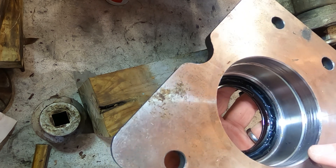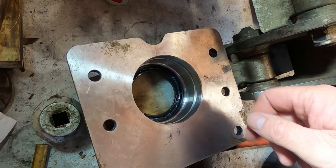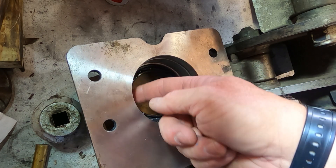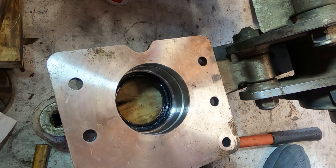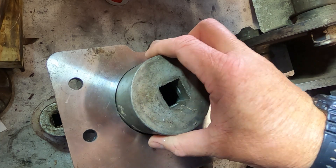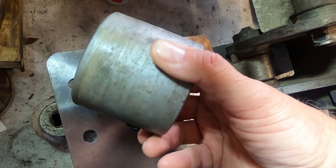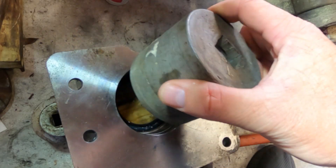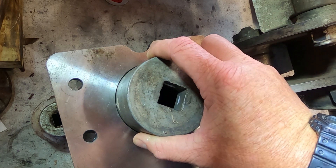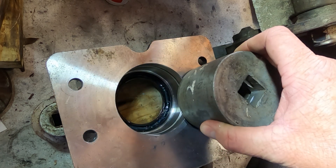Now that we got our grease seals pressed in, we are ready to start putting the bearing in. Make sure this is perfectly clean — there's nothing down here. We want this thing to slide in, and if there's any gunk in there and it gets pushed in, it won't let the bearing go all the way in. I like to put a little bit of lube on this so hopefully it slides right in. I'm going to use this socket to drive that bearing down in there. This thing fits perfectly — I don't know what size socket it is, it is super thick-walled. Try to find something that fits in there nice and smooth and has a good lip on it, so it's sitting right on the race of the bearing when you drive it in.